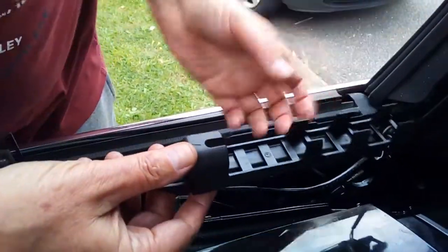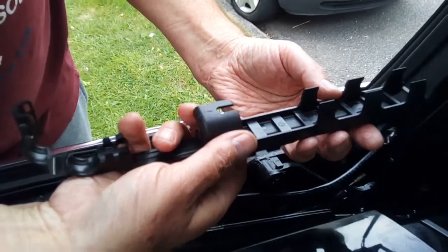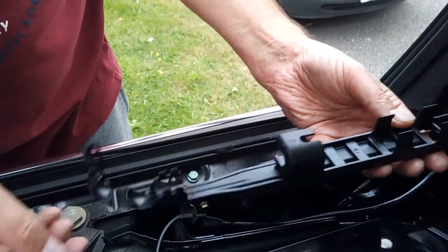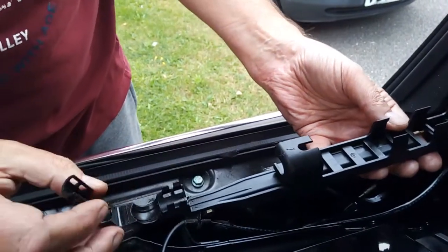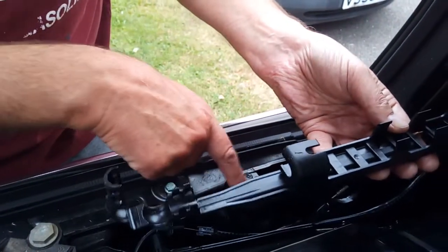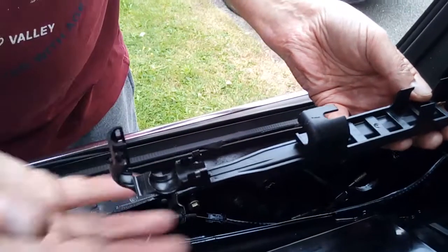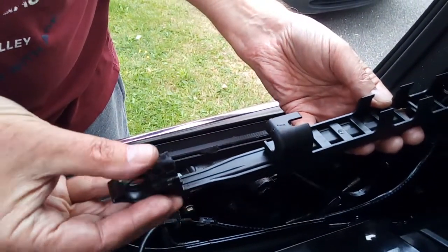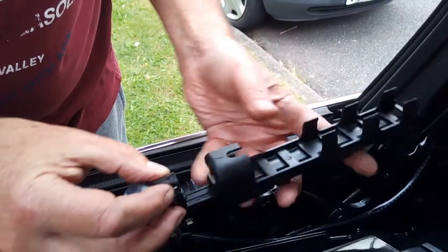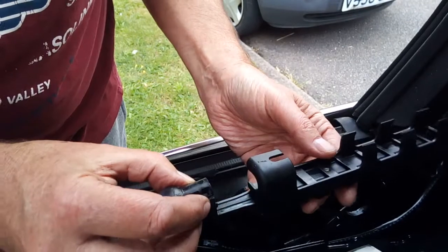This clips around — this end fits underneath and clips around the hydraulic ram. This bit extends forward to the end of the hydraulic ram where there's a knob, what I would call a rose joint, on the end of the hydraulic ram. That fits over the hydraulic ram like that and clips together, and then a tie wrap just goes on to hold it in place.